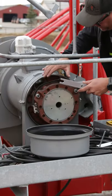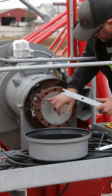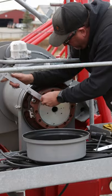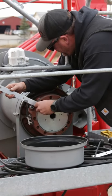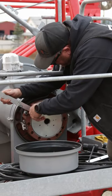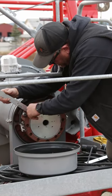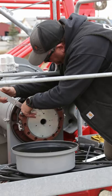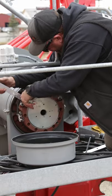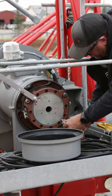What we'll see is in the top cover of this brake coil, there'll be two machined holes, 180 degrees from each other. We'll install the threaded portion of our tool in, turning the nut — this will actually thread into the brake disc itself. We will mate the end of our tool to the machined surface on the face of the coil until it's hand tight, and repeat the process on the other side.